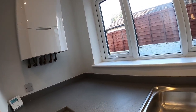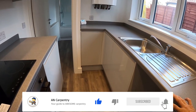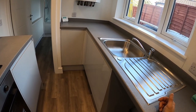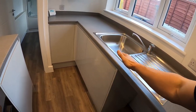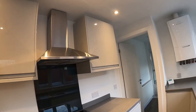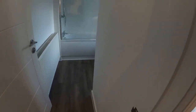The kitchen is great apart from that, and quite solid. I personally like it better than units that come pre-assembled, because the back is thicker and you nail your backs on yourself — it's not pre-rigidly set. That gives you a little bit of movement if you need to adjust things. When they come pre-assembled they've got staples in the back so they're rigid, and if it's nailed on square — which I have had in the past — you can't get the unit where you want it, and it can throw off end panels.